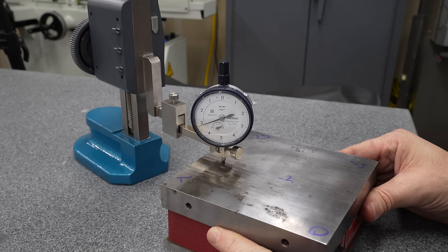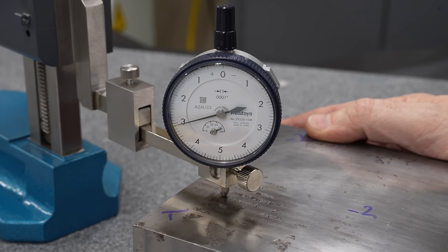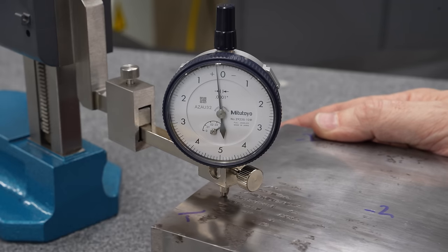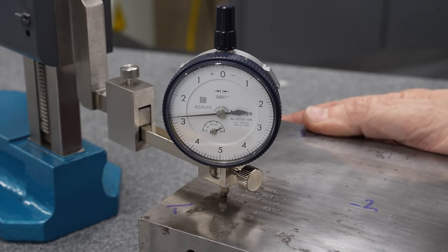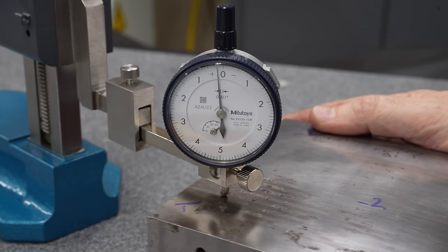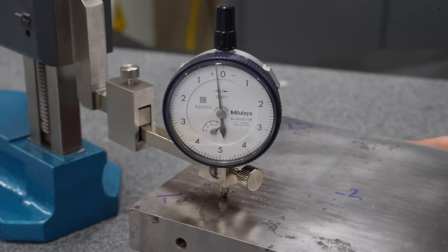And this has a longer range, so we can read the depths of some of these pits. Now again, there's a ball tip on this as well, so we're not getting the full story. But this is dropping in a full 5/1000ths of an inch in the deepest pits that I can see. I fished around here for a while, and minus five is just about the deepest I could find. So we know we're going to have to take off at least 5 thousandths, but it's probably not too much